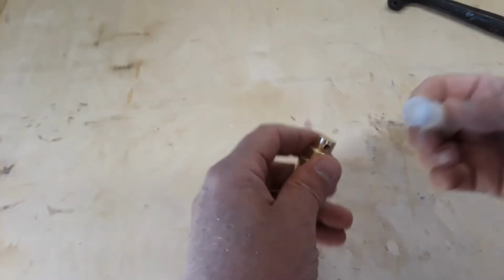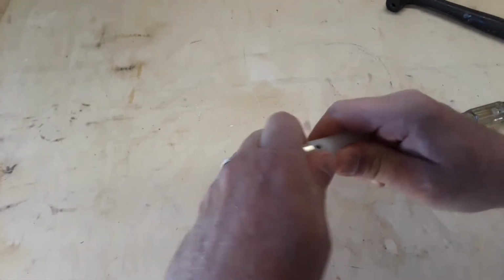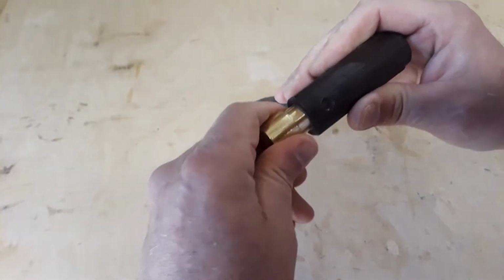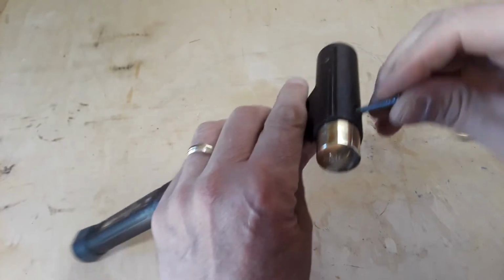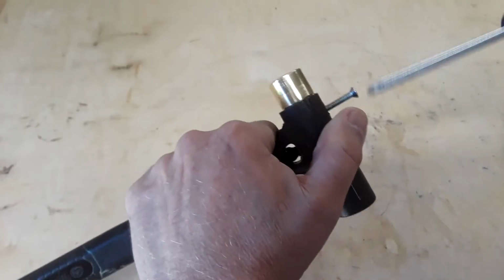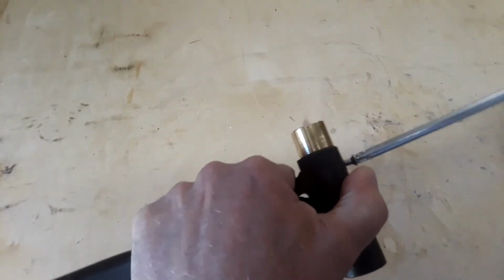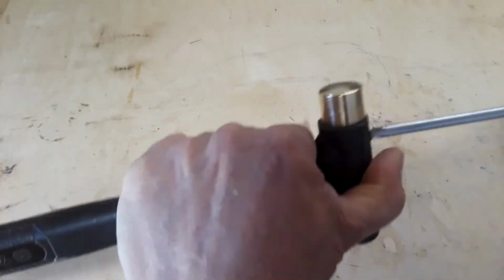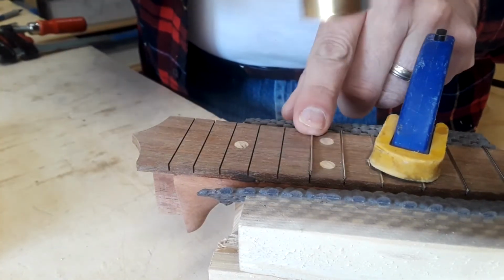The small shaft on the brass head is 1/2 inch in diameter, and it fits snugly into the 1/2 inch hole that is drilled into the end of the HDPE. A 1/8 inch hole was drilled crosswise through the hammerhead, HDPE shaft, and brass head. The brass head was tapped with 8-32 threads. This allows them to all be screwed tightly together. I had used the hammer when the parts were just pressure fitted, and it worked fine, but I thought that over time things might start to loosen up and something might break because it's a hammer.